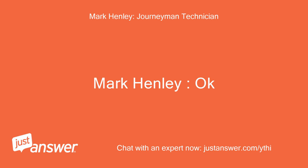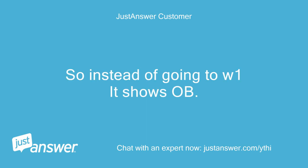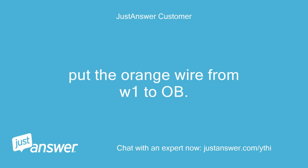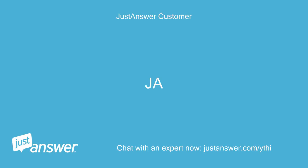Mark Henley: Okay. So instead of going to W1 it shows OB. Should I change that over? Put the orange wire from W1 to OB. Mark Henley: Yes. Okay, changed it over.